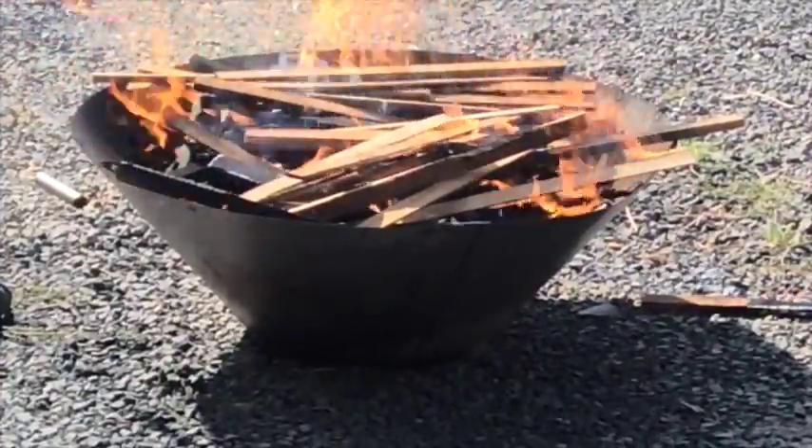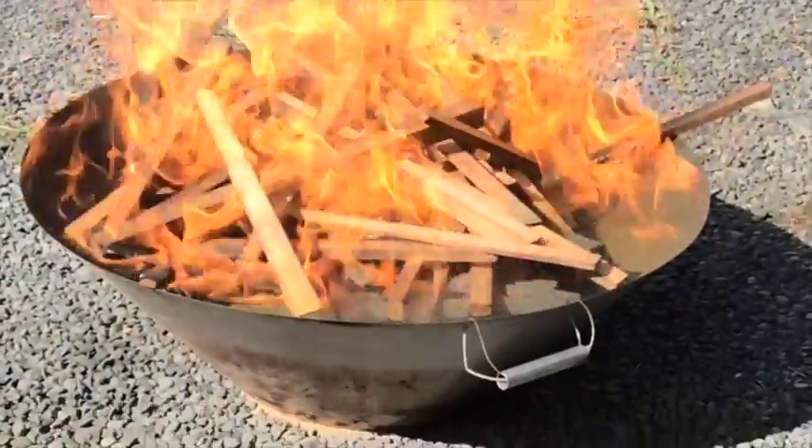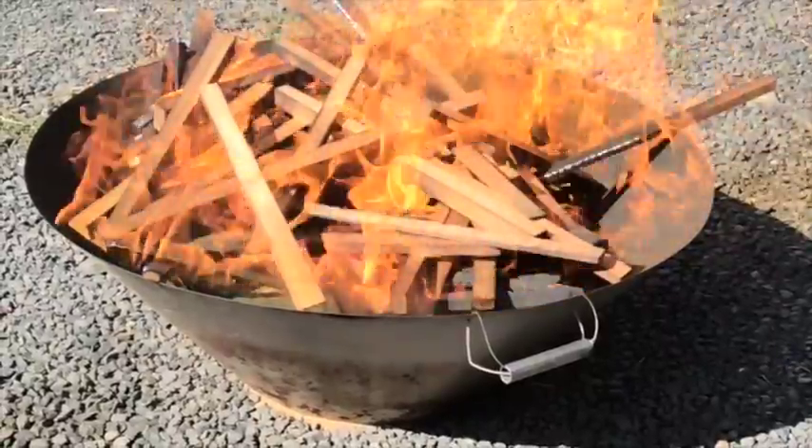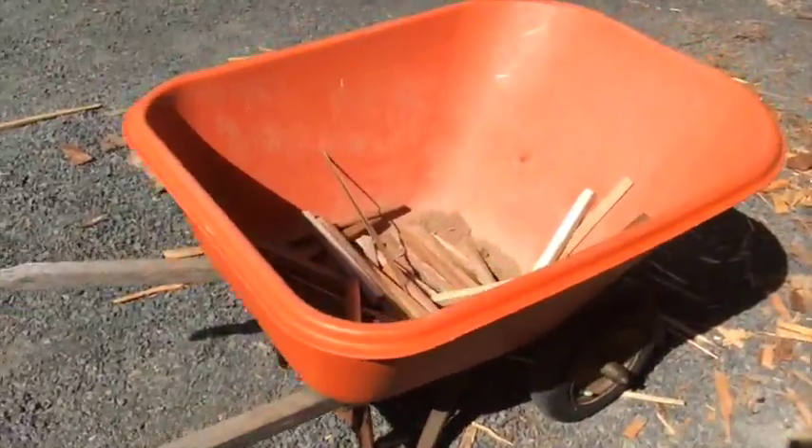At the mid phase of burning you will see the flame actually burning above the top of the kiln, because the gases are being baked out of the material below. Since the oxygen is being consumed in the top of the kiln, the wood does not burn but instead turns into charcoal.